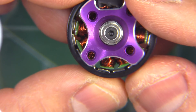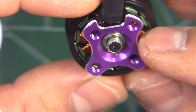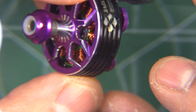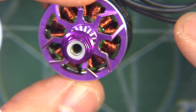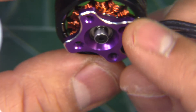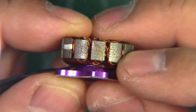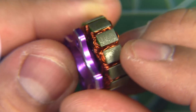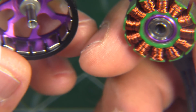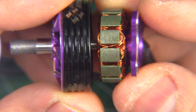The air gap doesn't seem to be overly tight. One thing many people have noticed is that if the air gap is too tight the motor can make a lot of noise — it causes electrical feedback when you're off throttle, making it twitchy. In some cases a larger air gap is actually advantageous because it makes the motor much smoother on and off throttle transitions. The laminations appear to be 0.2mm, so overall the motor has a lot of the latest features expected from high-performance motors.